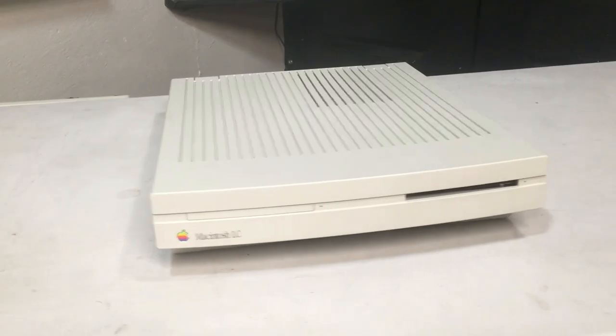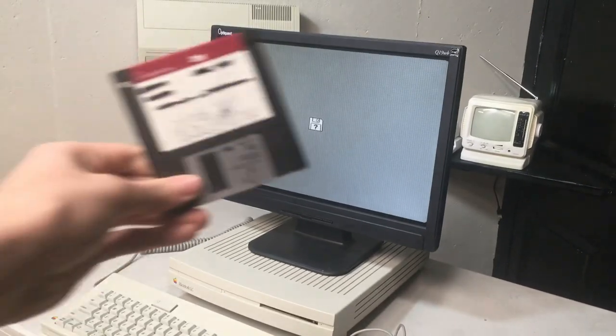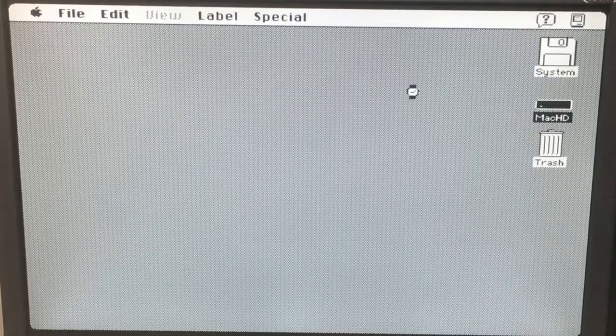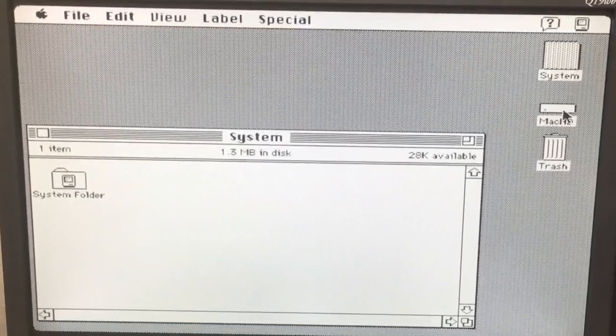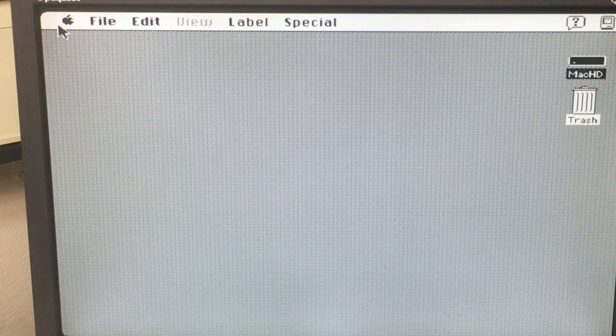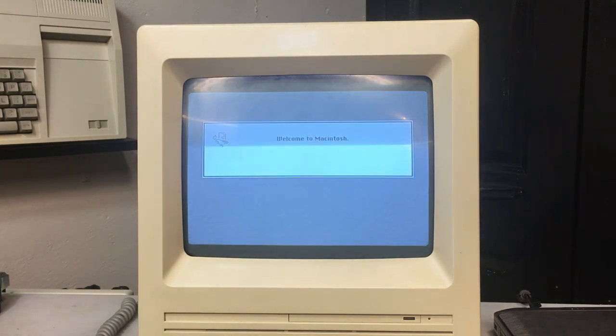For most of this video I'll be using my original Macintosh LC with 10 MB of RAM. Since the pre-included GitHub images aren't bootable, I boot from a System 7 floppy disk. Sure enough, at the desktop the hard drive image was initialized and ready to go. I copied the System folder from the floppy onto the hard drive, ejected the floppy, and restarted — and this thing is pretty fast. The time from when the hard drive first starts being read to when the system is fully loaded is only about 11 seconds.